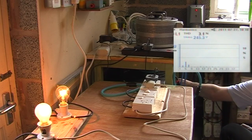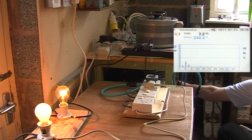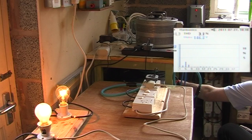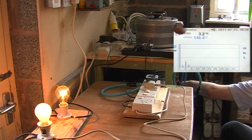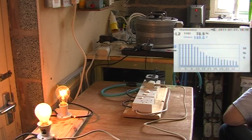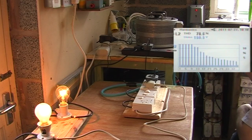While we're here, we can take a look at the really technical stuff — the distortion. That's the output from the Variac. You can see it's the mains frequency, and these are multiples of the mains frequency. Now that's the output from the dimmer switch — lots of distortion at higher frequencies.